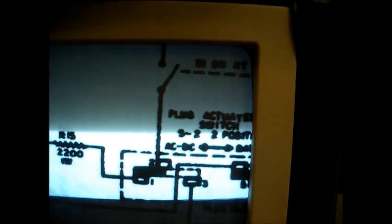So in other words, equal current for a series circuit, which means less battery drain. If they wired the tube filaments in parallel, we'd have more current draw because the current that each branch consumes would add up. So that's probably why they went with a series string here. But yeah, our filament voltage comes off right here. And that's what I'm interested in now.